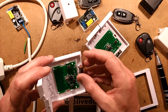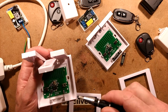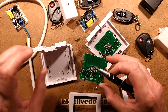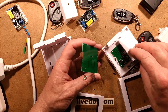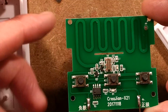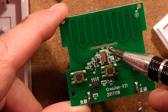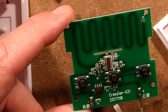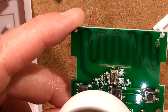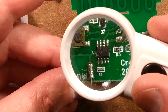So this takes a little battery like this. There's a really nice feature - something I particularly like about the two-way switch. Before I put this in, let's pop the circuit board out and take a look at the back of it. It's kind of clipped in and it's got a little support here. There's not really much in the back - let's take a closer look. It's got that fairly chunky antenna with good spacing. It's got an anti-tracking slot, but I think it's just in case moisture gets in and affects such a delicate bit of circuitry. The chip has a number on it - it does 1527, and then underneath 1775P with the letters EV on it.